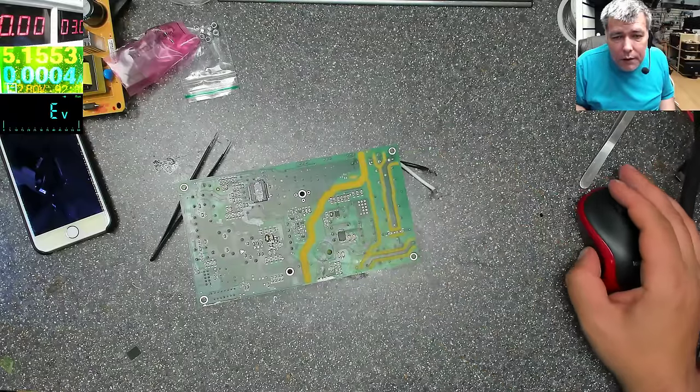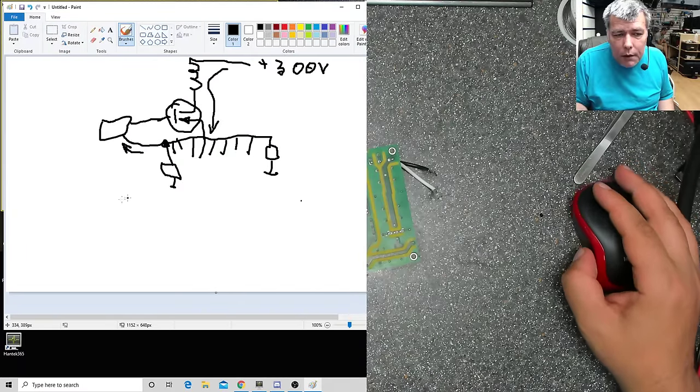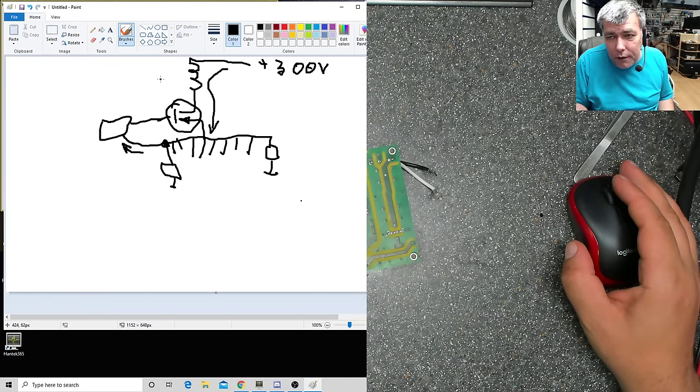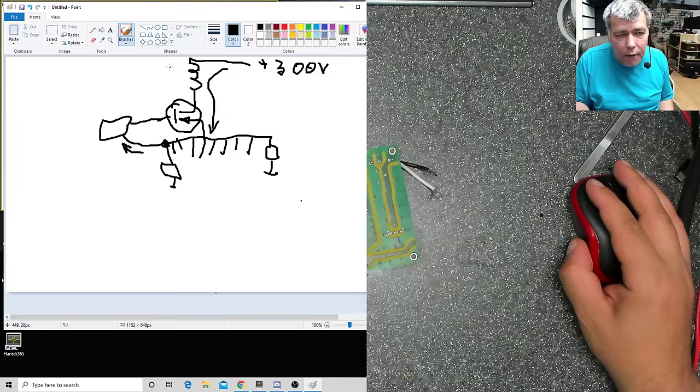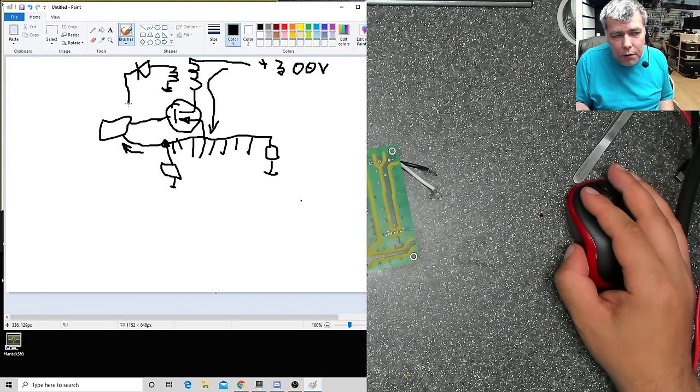Next, you know what it's about? So that's the main transformer there. Also, you have a second coil from this transformer. You have the second high voltage coil. No high voltage on the high voltage side, okay? And this one is ground. This one has a diode, and it's generating voltage for this chip. This is a low voltage one. You have also a capacitor here.